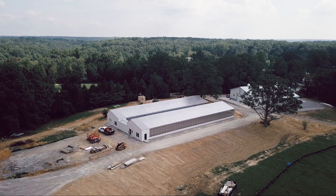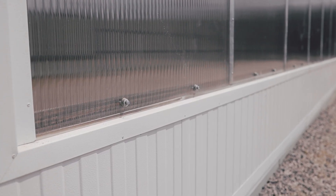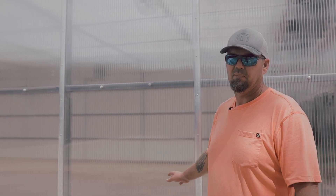The south wall and south roof are triple-walled polycarbonate panels — the heaviest, thickest polycarbonate panels available. They provide great insulation as well as being durable and long-lasting, with specialized fasteners and all-aluminum channel to hold them together. A lot of guys cut them with a skill saw, which shreds the polycarbonate and drives those shreds into the straws of the panel — you then have to remove them, otherwise they build up and when convection starts they rise through the straws creating light deflection and an overall bad look. We cut them with an abrasive cutoff wheel, which melts rather than shreds, so there's no material built up inside.